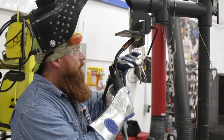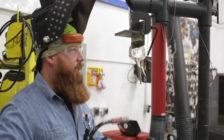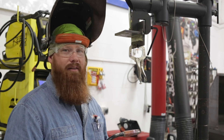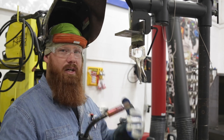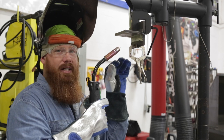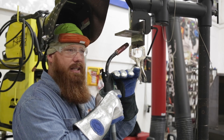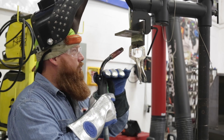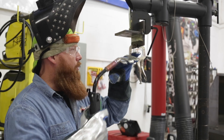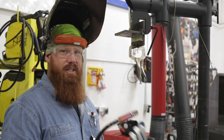That's just going to help stabilize me. We're trying to show and educate people, give them little tips and tricks to maintain consistency. When you start out welding, the biggest problem is inconsistency. This is going to help stabilize you so you can focus on contact tip to work distance, travel speed, and work angle. A lot of people have a tendency to get too close or pull too far back, which has a big effect on your amperage. Many people also have a natural sway they don't recognize. I prefer everyone to have three points of contact — two feet on the ground, one hand supporting against the material — and then prop up an elbow or hip for added stability.